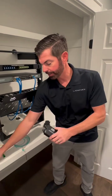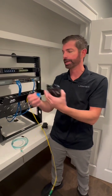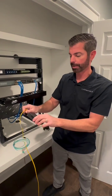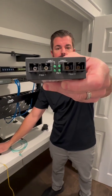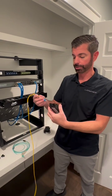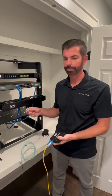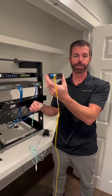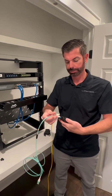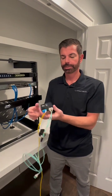You would take a single-mode — you'd typically be coming out of a rack or something and then going to another location. On one end it has SC duplex ports. I'll pop the dust caps off so you can see. They're SC duplex ports. On one side you would put your single-mode in — I have another patch cable here just to show you so you can visualize it. You'd be coming out with another patch cable on the multi-mode side. You would want to clean your connectors prior to doing this, obviously, but it's that simple.